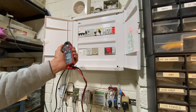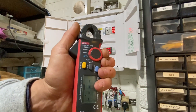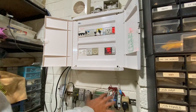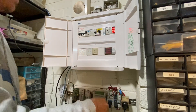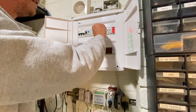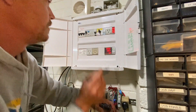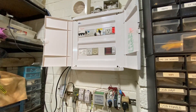So let's demo that today. I'll demo it using what I find easiest — I'll put the meter into continuity mode and do an active earth fault. We're going to trip this one here first. If you're wondering why there's a live panel down here below, that's what this switch is for — I can actually isolate this so we know all of this is safe to touch. It's key operated. So let's just perform a fault on it — active earth. And this should trip this one up here. Bang. Works like a charm.